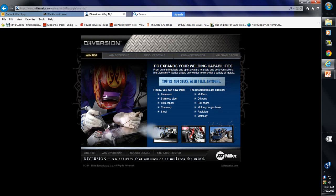TIG uses a tungsten electrode because tungsten withstands the highest heat before melting — it's the same element used in incandescent light bulbs. When thin and very hot, tungsten illuminates. In welding it's essentially a non-consumable electrode: it gradually wears but doesn't deposit into the weld. That's why you add separate filler metal — the tungsten just provides the heat source and arc, and you're not supposed to be depositing tungsten into the weld.